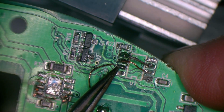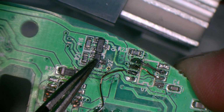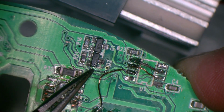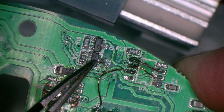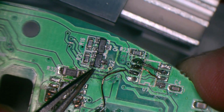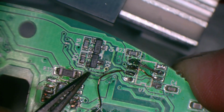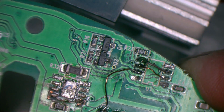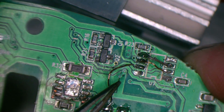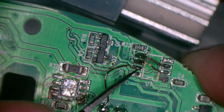And this pin goes to this transistor, which actually, when turned on, feeds 5 volt to the laser diode regulator, the main supply. So not only can they turn off the supply to that regulator, they also control the enable pin. So I'm not sure why they would do that, maybe as a fail-safe, because you don't want lasers if they happen to be on, or maybe it's supposed to turn off with the rotation feature. I'm not too sure what the goal is, because it's a bit funny in the software. So I've permanently wired that on.